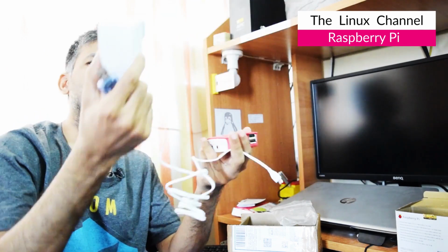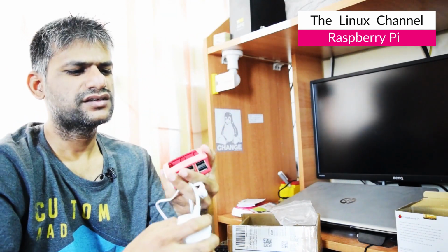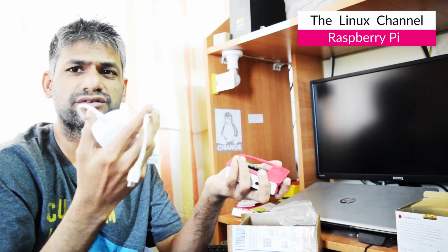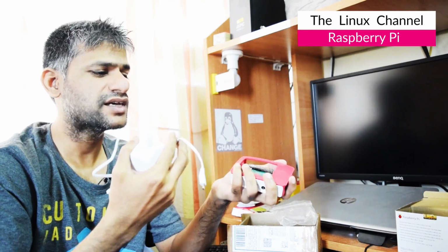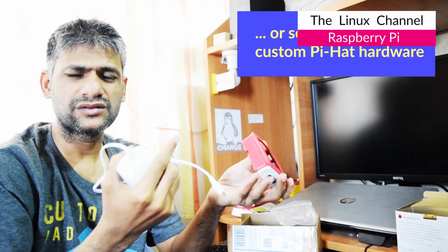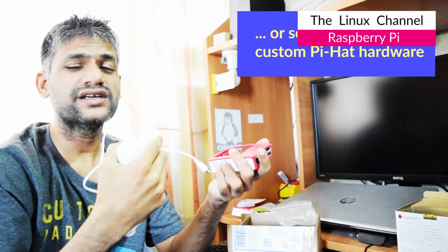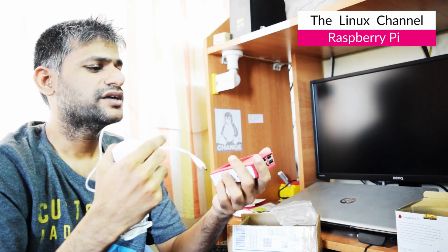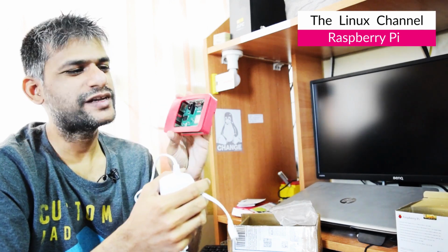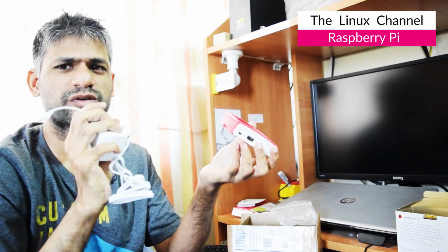And also this is useful if you drive any relays and stuff like that, and you have some amount of power left, and you can use this as a source for that relay as well. You can do that as well as with stepper motors and so on. I do that kind of thing with my Arduino, and it really helps to have a proper power supply as a priority, rather than the board itself. Let it be Raspberry Pi or let it be Arduino, choose a proper power supply.